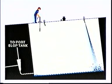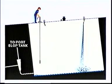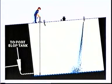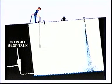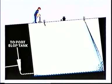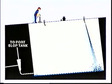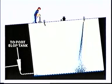You have to dip the aft end of the tank regularly to detect eventual build-ups of water. Stop the bottom washing for a short time while doing this. If water should build up, you will have to stop one or two guns while draining the tank. And of course, you must try to find out why the eductor isn't taking care of four guns.